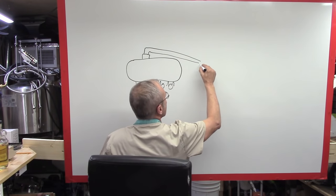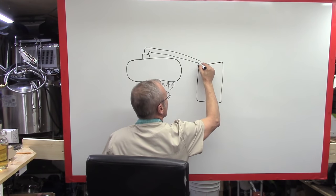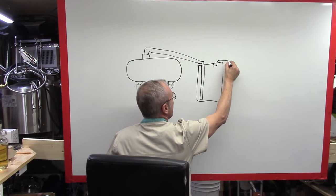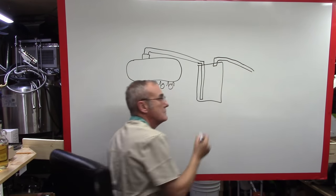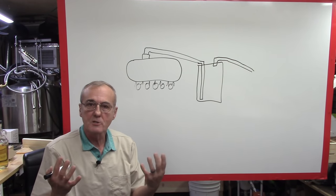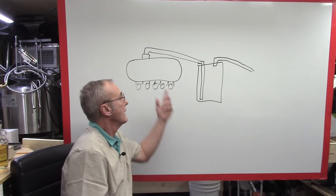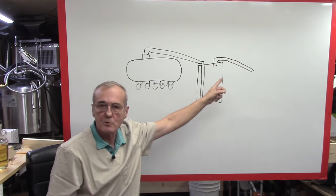So they had a large container. And what they did was they inserted this line arm into the container all the way down to the bottom. And then they extended the line arm back out the top again that went to the coil. Now, this was known as a thumper. And what happened was your high pressure, which is something we want to avoid, we'll get to that, high temperature vapor enters into the line arm and bubbles out the bottom and starts to rise. Now, as it does that, it cools.